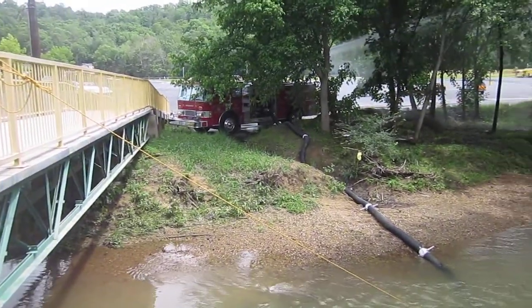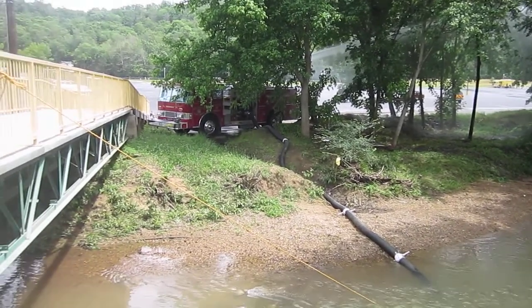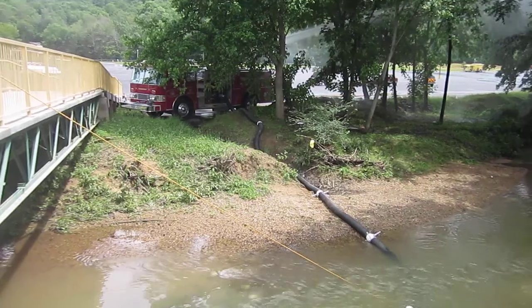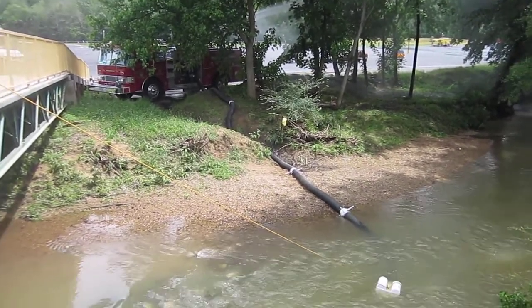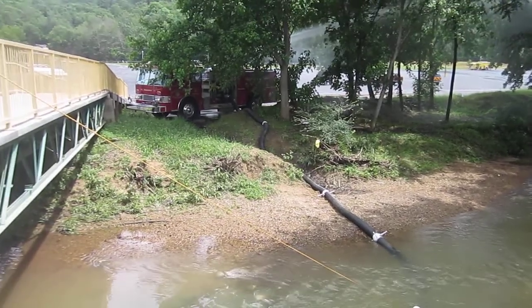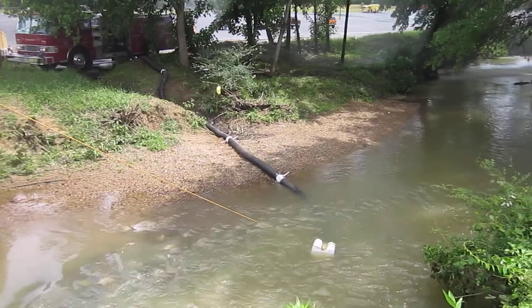And that's where they're able to load those tankers at over a thousand gallons a minute. So again, back to our saying about you've got to carry more than 20 feet of hard sleeve on your rural pumpers, especially when you need to access really good water like that.